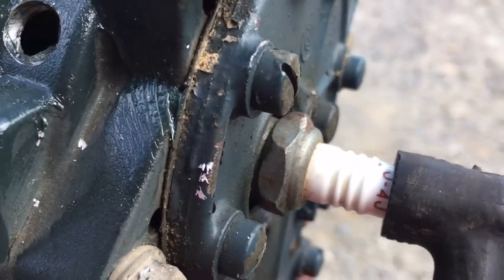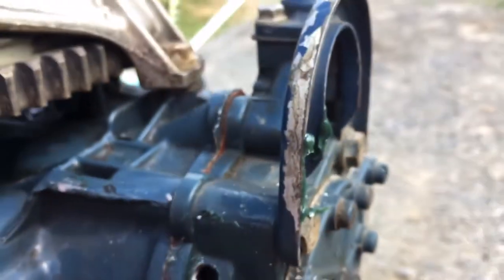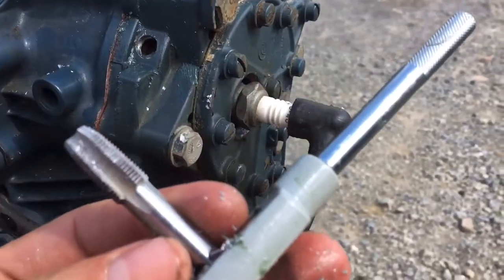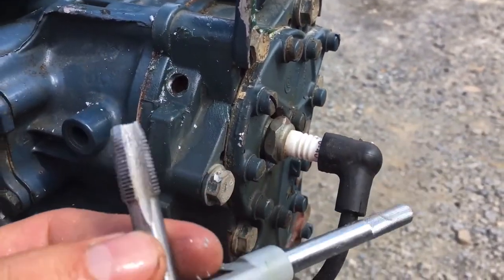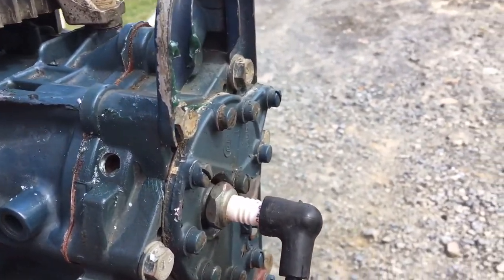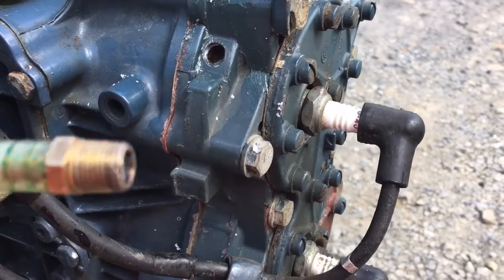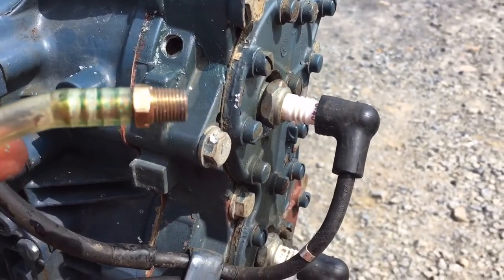You can see down in that hole — didn't really get anything inside. So I'm getting ready to use the tap and die here and go ahead and thread this out. I've checked this on a piece of aluminum with the fitting I'm going to be using. This fitting is actually off of another one that I'd already done this on, so it's been in use for years.